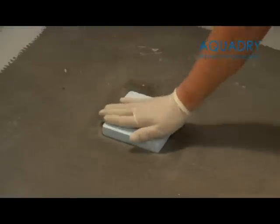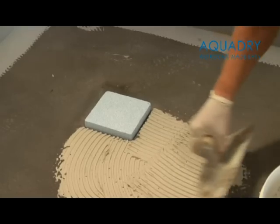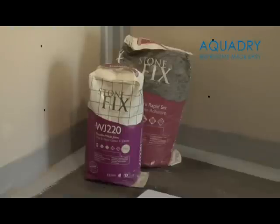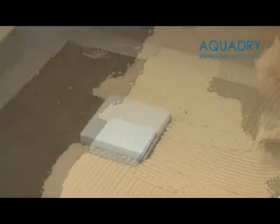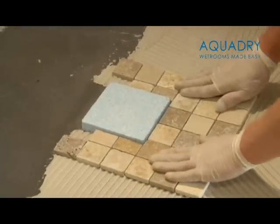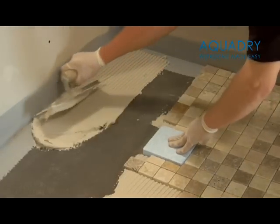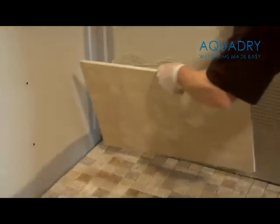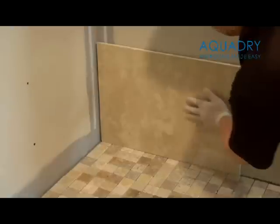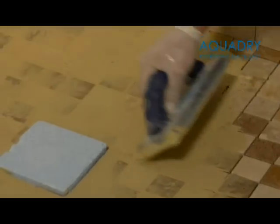Place the disposable tiling aid into the drain. Using a suitable flexible tiling adhesive, begin tiling. For tiling these shower bases, we recommend the use of an S1 cement based tile adhesive with flexible additives, such as stone fix, which will give you a very high adhesion grip and a good degree of flexibility. The beauty about these tileable shower trays is that they can be tiled in many different types and sizes of tile. It is however very important to note the following: we would recommend a tile that offers a good slip resistance, as a high polished tile combined with soapy water can sometimes be very slippy. Regarding the size of the tiles, any size tile can be used. However, if you use a tile bigger than 100mm in any direction, then the tiler must follow the falls in the shower tray with a cut line in order to maintain the pre-manufactured falls in the shower base. Here we are showing the tiling in a small mosaic, which as you can see does not require cuts to accommodate these falls.